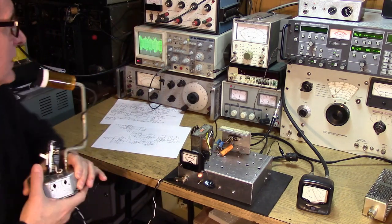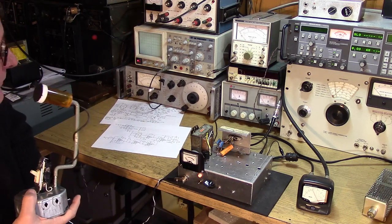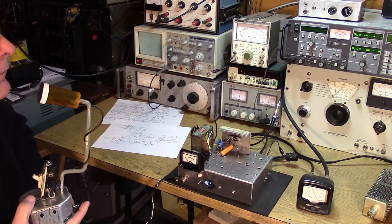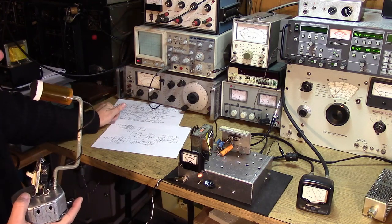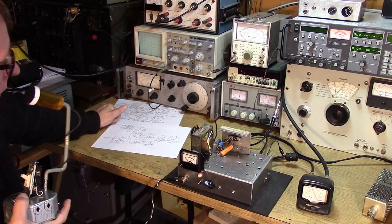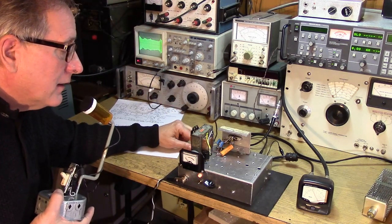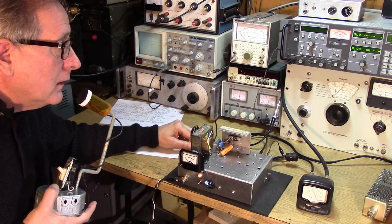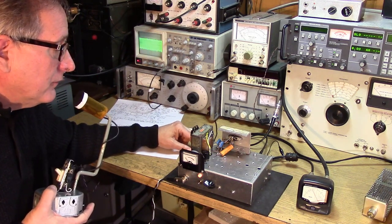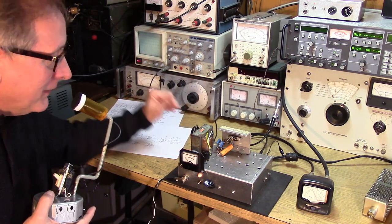Well, Tim, I actually have a whole extra op amp in there that I'm not using. So I have plenty of opportunity to put in shaping, extra gain, negative limiting, negative peak limiting. So there's several things I can do to this thing because I've got an extra op amp in there. And it's a very, very simple circuit. This is first principles PDM. I mean, this is cigar box PDM, if you want.